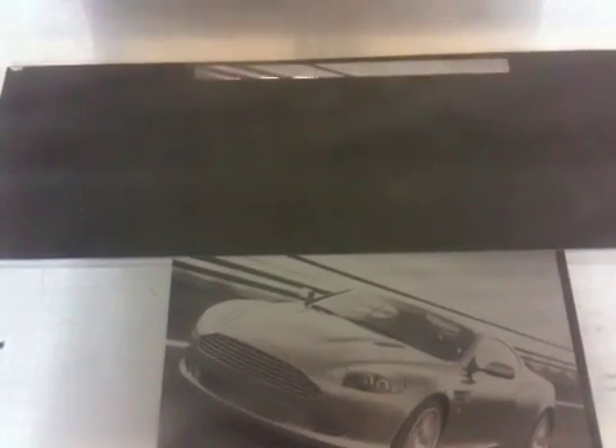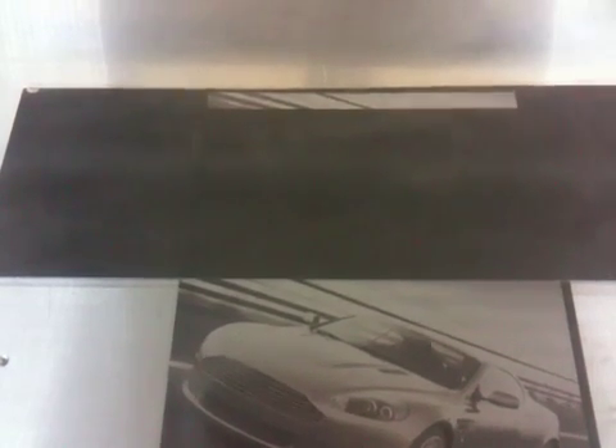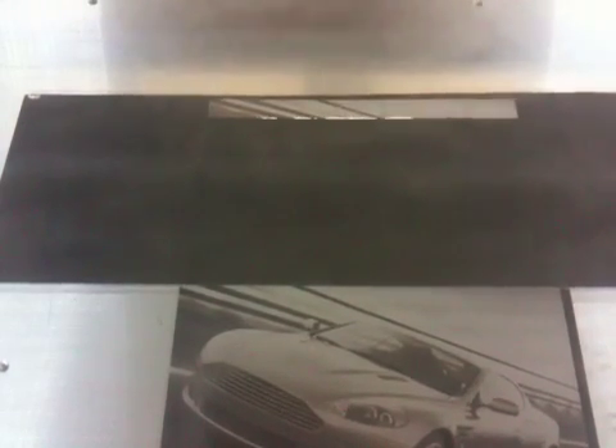It's a CO2 laser. It also has indoor LED lighting so you can see what you're engraving. We're running at 20% power and 100% speed, at 500 dots per inch. This was all programmed straight through Corel.